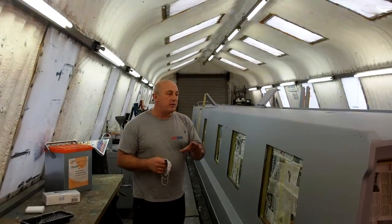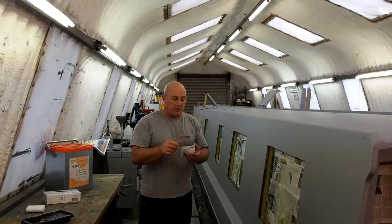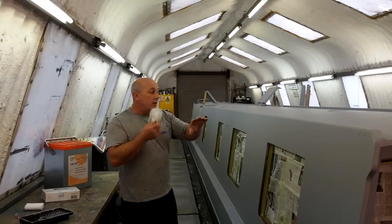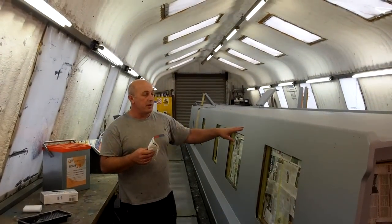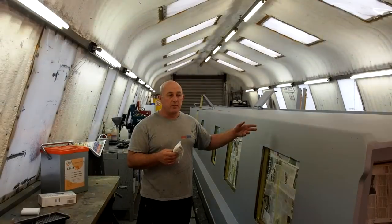I don't suspect you're going to be able to hold your breath for the length of the boat — that might be asking a little too much. But if you pop a dust mask on as you paint, it has nothing to do with you. A dust mask is just going to catch the moisture from your breath, stops it going on to the steel, and you've got no worries about literally painting on top of water as you're breathing on cold steel.